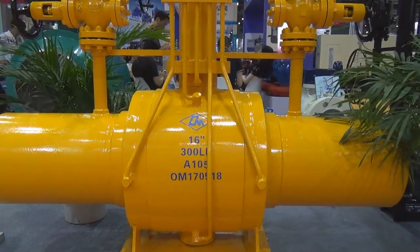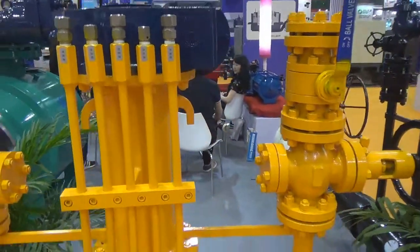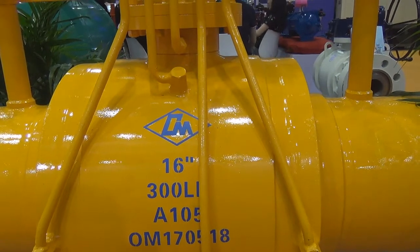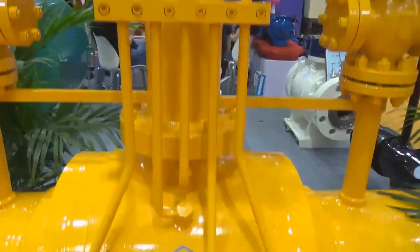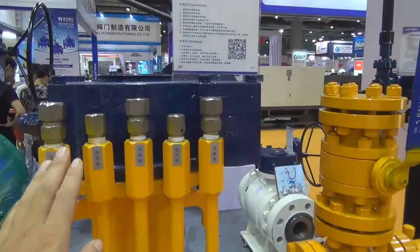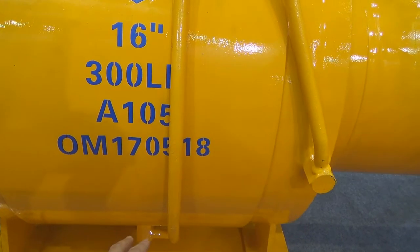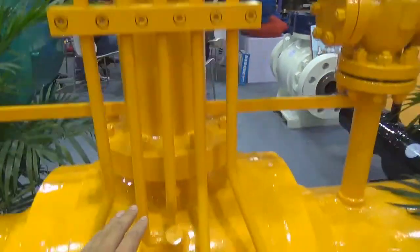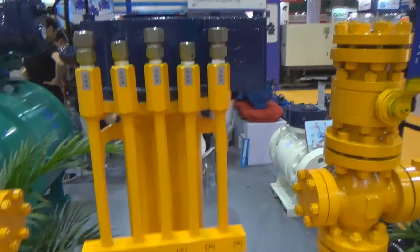Here is another fully welded buried ball valve - the function is the same. This ball valve body also has five pipes located on the valve body and the five pipes have the same functions. These two or three pipes are going to protect the valve seat - if the valve seat leaks, we can put some special medium inside the pipe and the special medium will seal the valve. We can also protect the packing area with this pipe. And the other two pipes have different functions - one pipe connects with the bottom of the valve, as this area always accumulates a lot of dust inside so we can use this pipe to clean the valve. And another connects with the valve body cavity, so if the cavity has pressure we can use this pipe to vent the cavity pressure to protect the valve body.